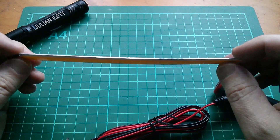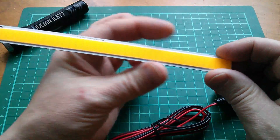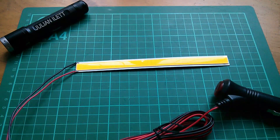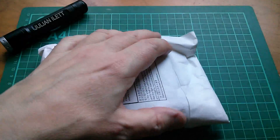Good value at $1.89 for this 17cm strip with 84 LEDs, though they appear to be in groups of four. It does get quite warm at 12 volts and very hot at 14 volts. The major problem would be mounting — you'd probably need some sort of clip arrangement to hold it down onto a metal bar to dissipate the heat. Cheap, but possibly a bit impractical.